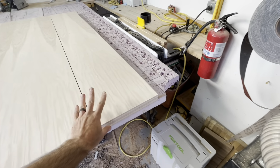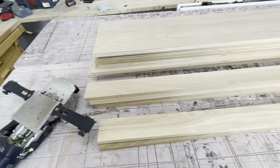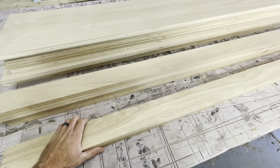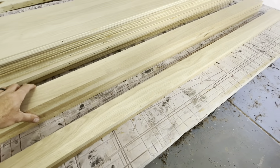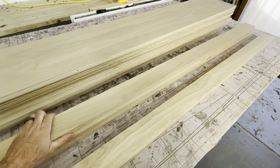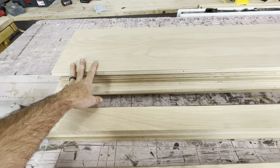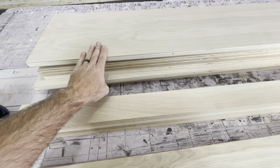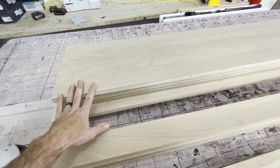Out of this first sheet I was able to get two bench tops and a single shelf. I've presented all the parts in the orientation I'm going to be cutting — these are the backs of the two benches and the backs of the shelves. I wanted to make sure I'm cutting into the less beautiful side; the grain on the better side is much nicer. For the tops of the shelves, I need to orient them so my tool rests and cuts such that the top is flush, ensuring we don't have to do heavy-duty sanding and potentially harm the veneer on the plywood.